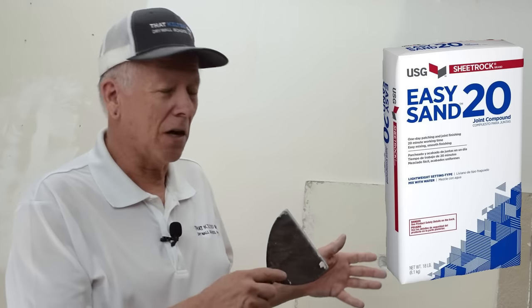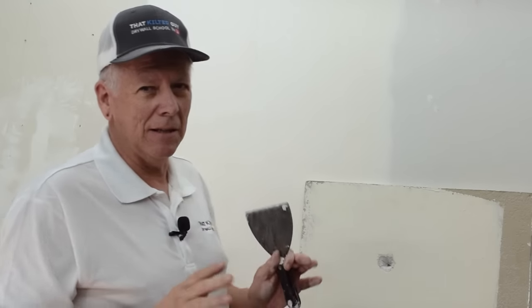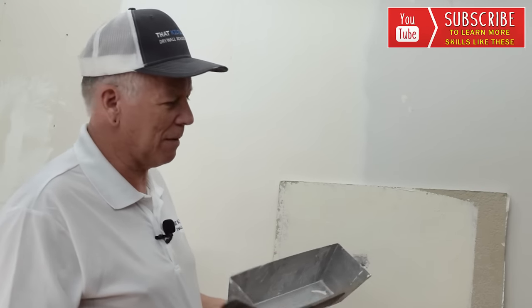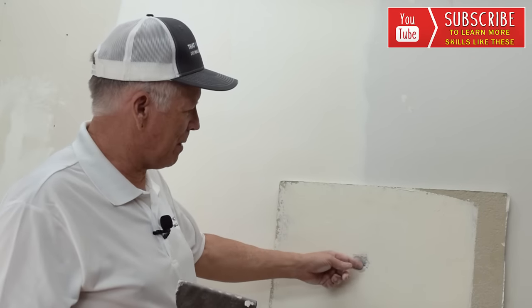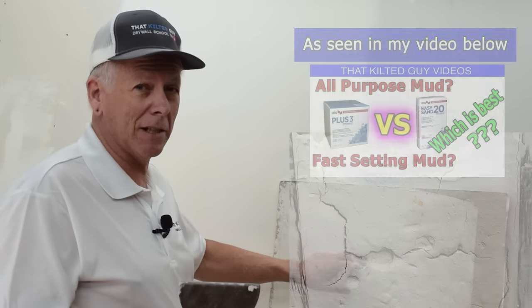What I'm going to use is five-minute hot mud — a fast-setting joint compound. If you guys are novices, I'd recommend sticking with 20-minute, because five-minute can set up in your pan before you even get it on the wall. I've done this for 35 years, so I can mix up a whole pan and spread it before it sets. Hot mud is a good choice because anytime you put mud on thick, you don't want regular joint compound — it takes forever to dry, it's weak, it shrinks terribly. But hot mud you can put on as thick as you want and it will harden without much shrinkage.